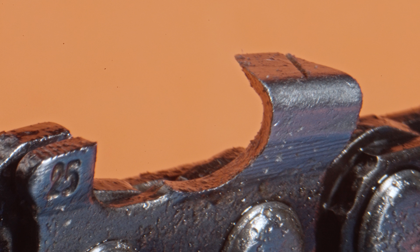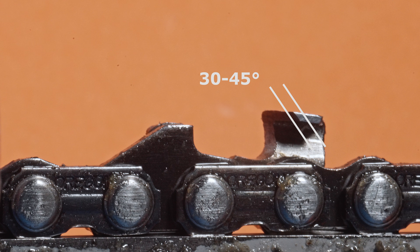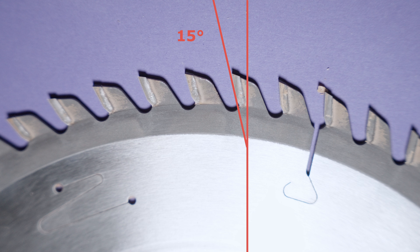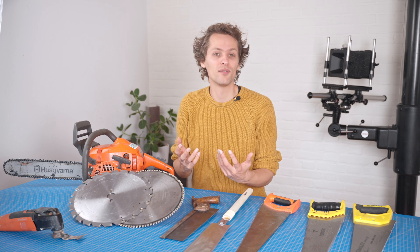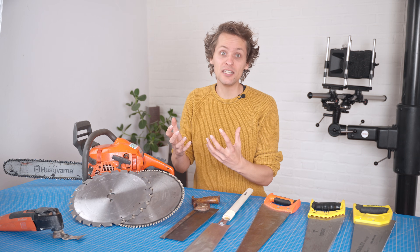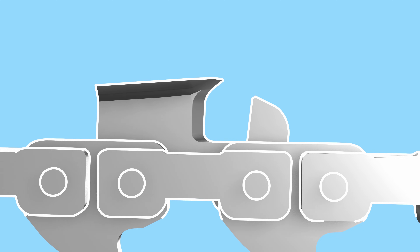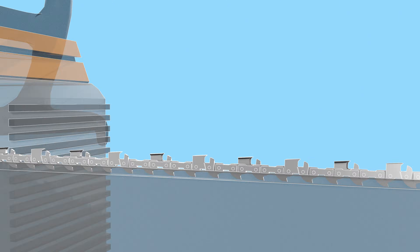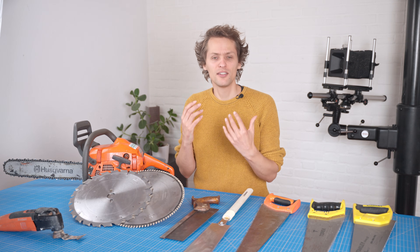Chainsaw teeth are a bit different than your regular chisel — they are basically a cross cut and a rip cut chisel in one. They cut on the bottom and the side at the same time, and they have a super aggressive rake angle, like 30 to 45 degrees, while table saw blades are in the 15 or minus 5 degree range. This high rake angle makes it cut more efficiently through soft wet wood, but it also likes to grab and dig itself into the wood. So a chainsaw chain also has a raker right in front of the chisel — basically a depth gauge that determines how deep a cut the chisel can take. And that's also where kickback comes from: at the tip, the curve makes the raker move out of the way, so that's where the chain can really suck itself into the wood.